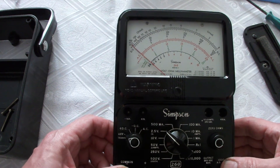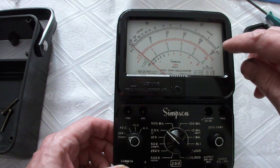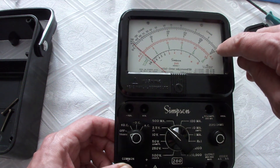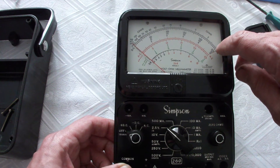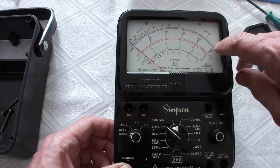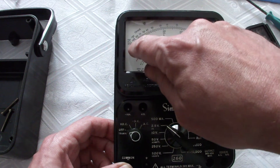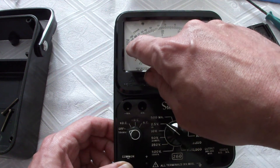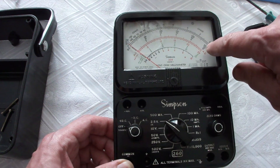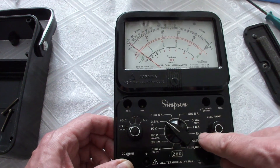The ohm range is upside down — you have to zero the ohm range at this point for times 100 and times 10,000, and for times one to 150 ohms you have to zero at this side, because the scale starts at this point and goes this way around up to 250 ohms. So here is zero ohm in the times one range.